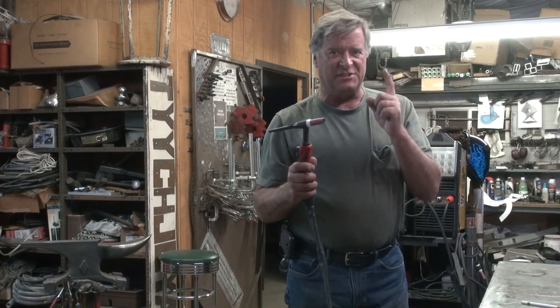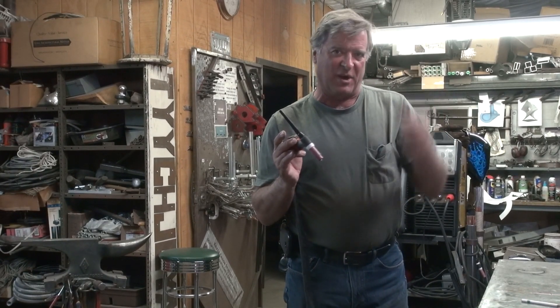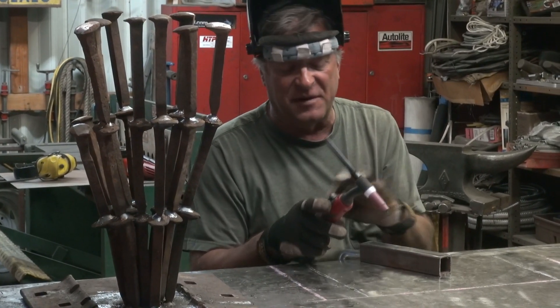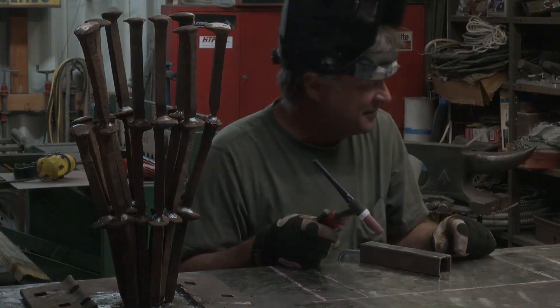With this machine, it's lift start only. You touch your tungsten to the metal, touch the button, and pick it up — your arc is now started. To stop, just touch the button again without dipping, and it'll turn itself off. Now I'm going to put my helmet on — let's spark it up and see how it does. We've got a clean piece of plate, a little box tube. We'll ride it from the minimum amp up to the maximum amp and back down again, just to make sure the control is working correctly.